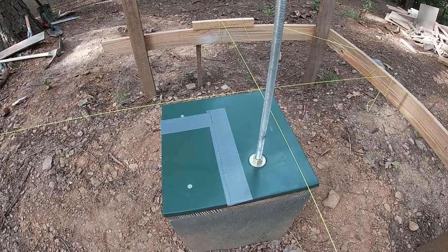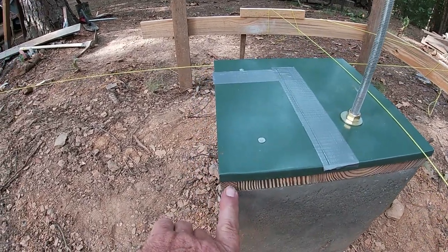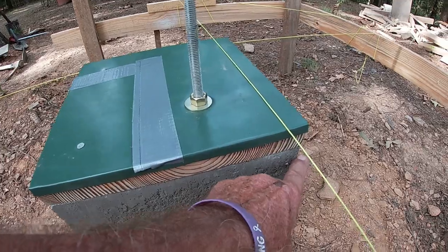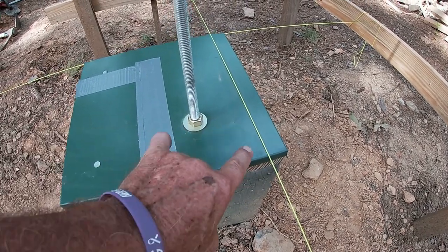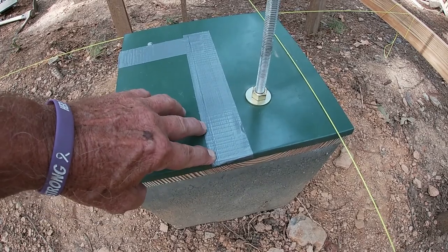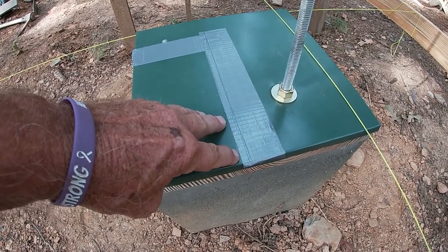What I've done on the tops of these piers is to cut some metal and cap the treated lumber. This is a two by twelve and I had to add on a little bit more — about three quarters of an inch — to make it a full twelve inches wide, which is what the pier size is: twelve by twelve. And I've got my string up. This is the outside of the building and I measured from the string back six inches, which is the actual inside face of the log, which will always be my control from the inside of the building.